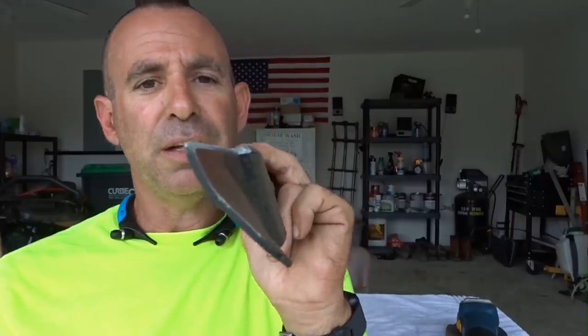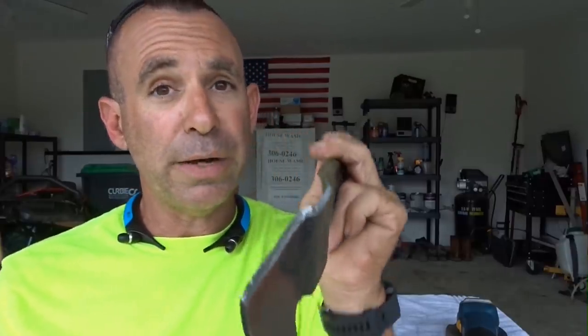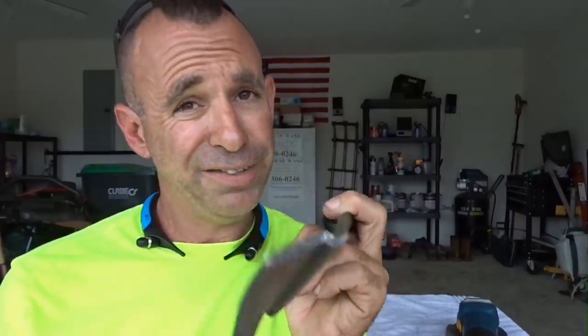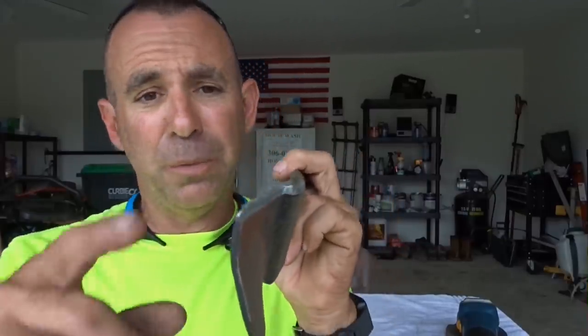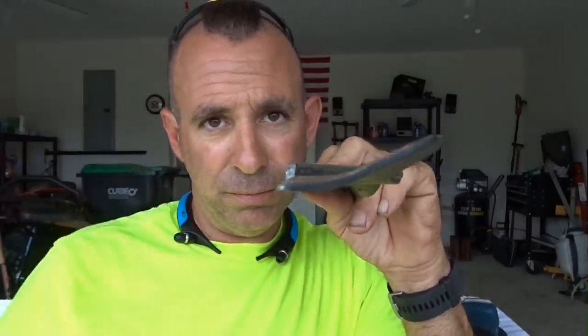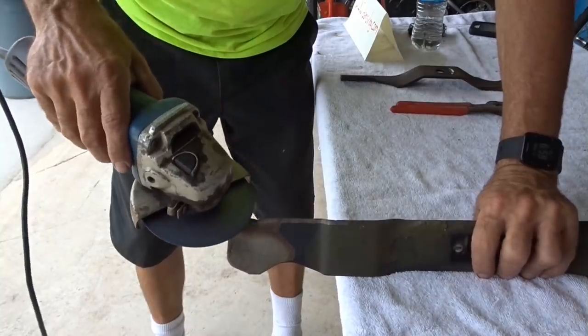That's easy to do. You could just come from the bottom and come from the top, make a quick razor, and you're done. You've got a set of super sharp blades and you're like, wow, I can slice paper. Fantastic. That blade will be shot by lunch. That's the problem. It'll be dull by lunch. There'll be no more angle. The idea is keep the angle. You got me? All right, let me shut up. Let me do some sharpening.